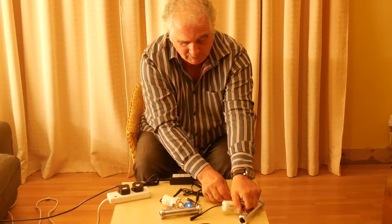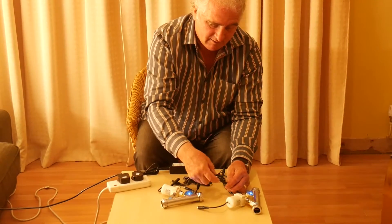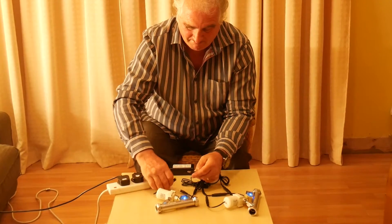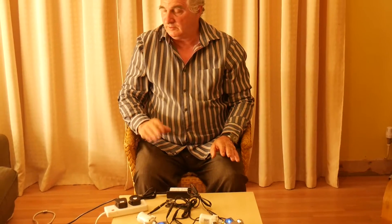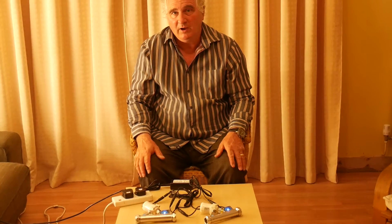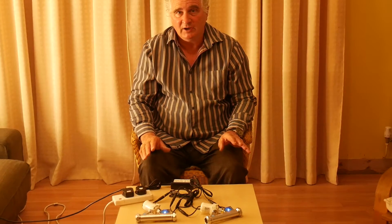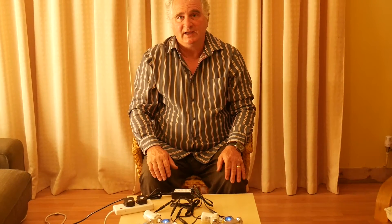These two spare wires — if it was just a single pump you'd put those two together. The four-way connects to one pump and the other pump, and as you can see all the wires are connected. There are diagrams in the manual and you should be able to follow it — it's easy when you know how. There's no way you can wire up any of these pumps so that it'll blow anything; you're not going to damage it. Light on means the flow switch is activated, and that's what you should see when you walk away — fully automatic on the hot and cold. Thank you very much.